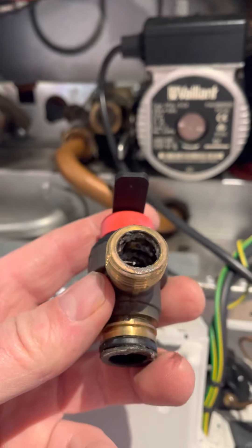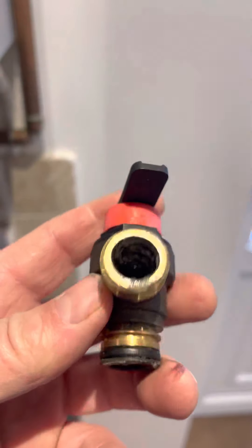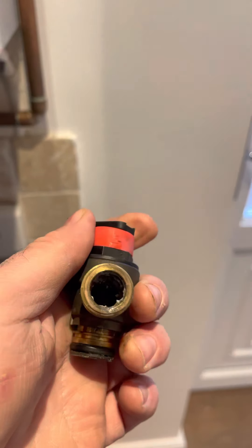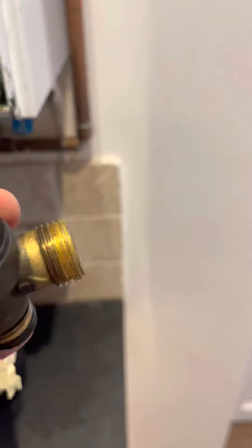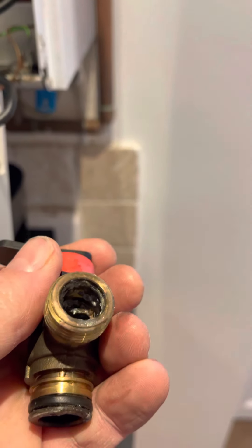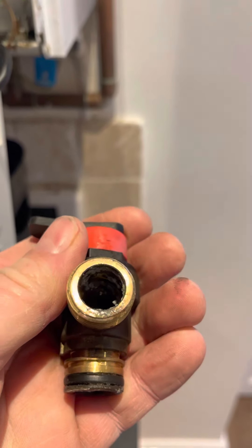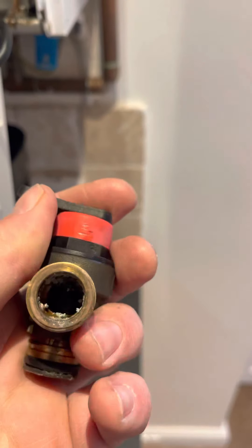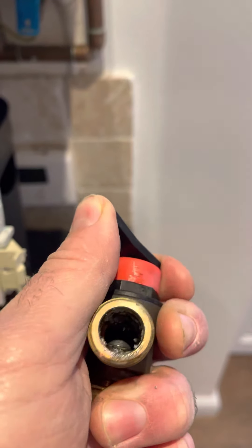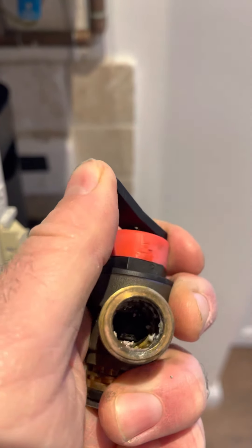As you can see inside there — getting under the light — when the pressure builds up too much in the boiler, past three bar, this thing blows off to protect your system, and it blows off after the 15mm outside, as most plumbers will know. The problem is, if you can see in there, there's a little diaphragm, and all that crap in there is what's been in the system. So when it builds up temperature, because the pressure vessel's gone, it blows off and opens up. But the crap in there gets stuck behind the washer, which means it continuously leaks pressure and water outside.